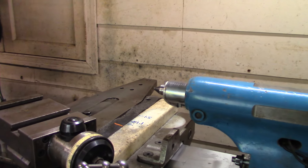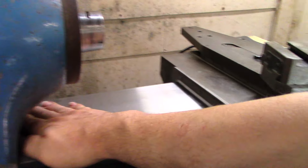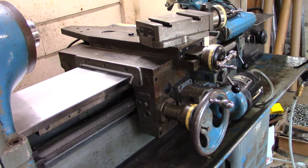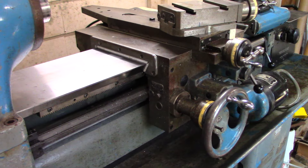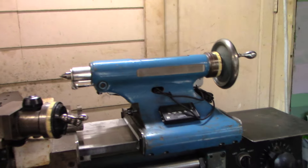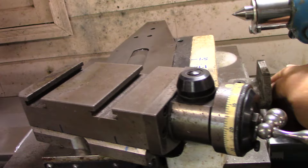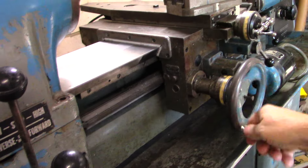This machine has been modified to make it less prone to wearing out. The usual ways that rely on an oiling system to hopefully separate metal from metal has been replaced with Delrin AF, which is a hard plastic with Teflon in it, so you could theoretically run this thing dry, but it does work better with light oil on the ways.